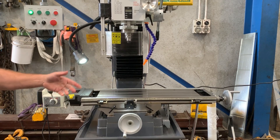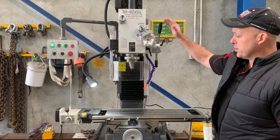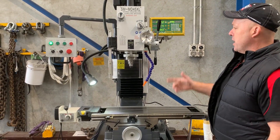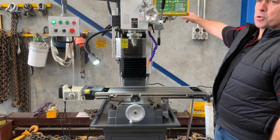Table feed is a key feature. Also on our 45 XL, which we've added in the last couple of years, is power spindle feed — also called Z-axis feed. When you're having a drilling application, having the Z-axis feed is very handy. Included with the machine: stand, drip tray, large table, power feed, and three-axis digital readouts.